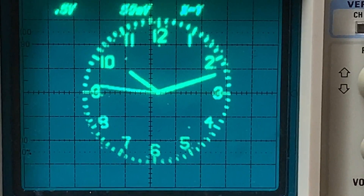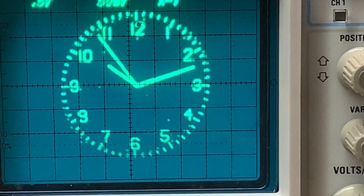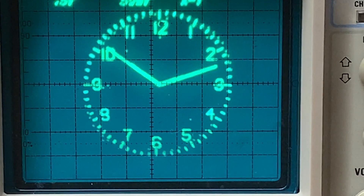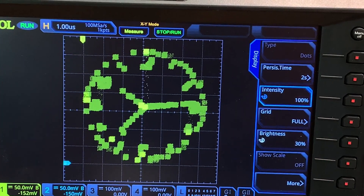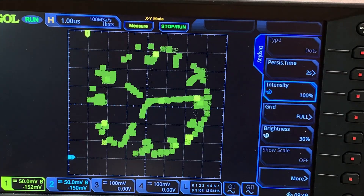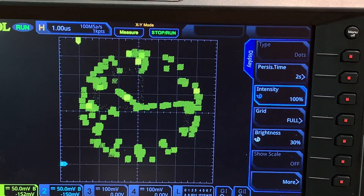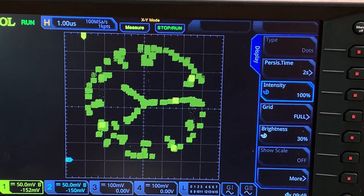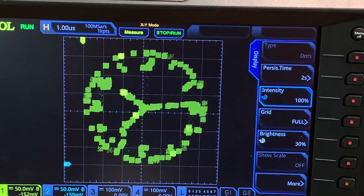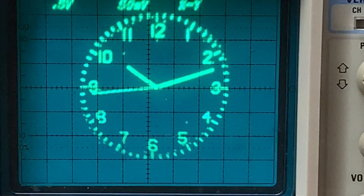Here is a video of the clock going, and it looks really nice. This is done on an analog oscilloscope, and this may be one of the very few cases where you have to have an analog oscilloscope. I tried it on my fancy Rigol and failed. If anybody knows how to make this look right on a Rigol, I would love that information. I tried persistence, memory depth, speed, averaging, high-res, limiting the bandwidth — I tried all kinds of stuff and this is as good as I could get. Definitely a fail on the Rigol, but on an analog oscilloscope this thing looks great.